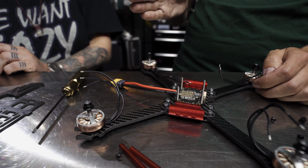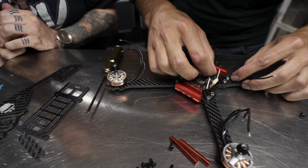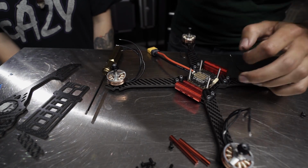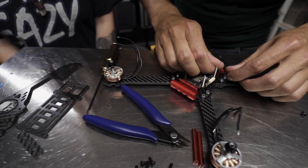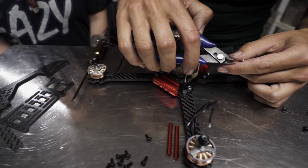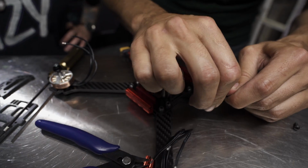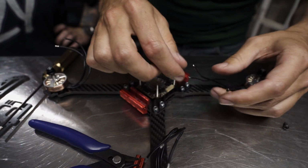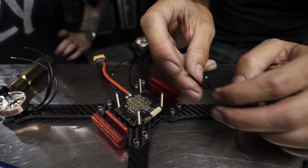But now we've got great configurators on the computer, so we'll just solder left to left, right to right, middle to middle. You want to leave a little slack, so I'll probably leave that one as long as it is. Then the middle one, and cut a little bit off here, and then this far right, cut it like there. On the ones where I cut off the pre-tin section, I need to strip it and tin it myself. And even this one that still has the tinning that came from the factory, I always like to put fresh solder on.